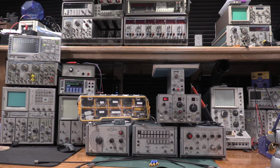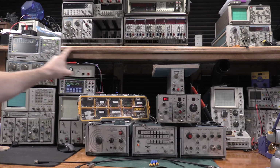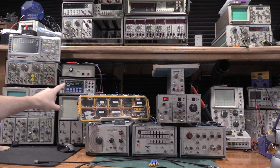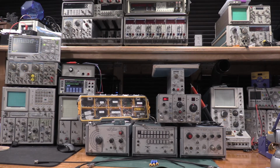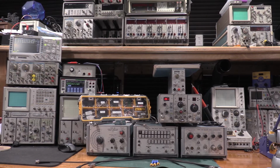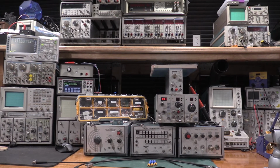So this is essentially from here up over, including the scope, the meter, maybe an analog scope, but scope, meter. This is the bare minimum you need to calibrate a Tektronix oscilloscope of the faster series. You do not need to get this elaborate if you're going after a 10 megahertz scope. Actually, there's a piece missing. I didn't move the variac. You also need a variac. But all this gear is used on the scope throughout the process.